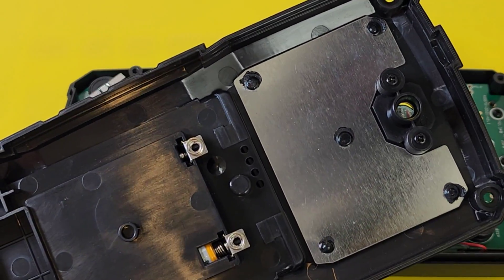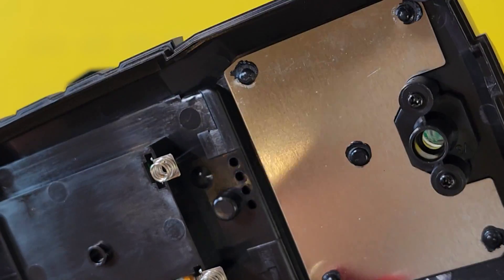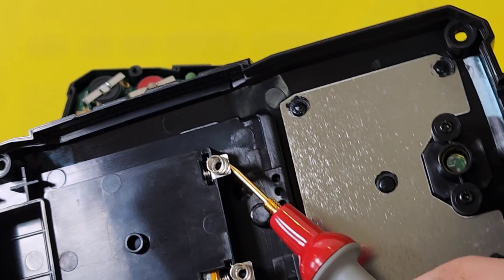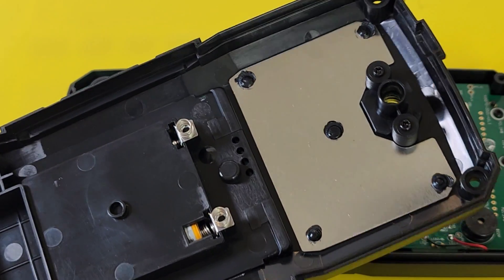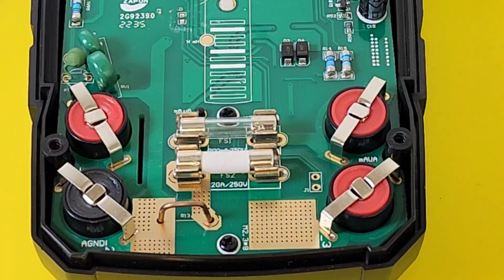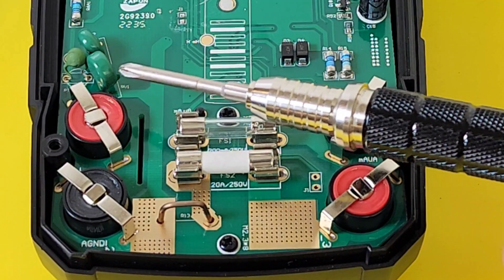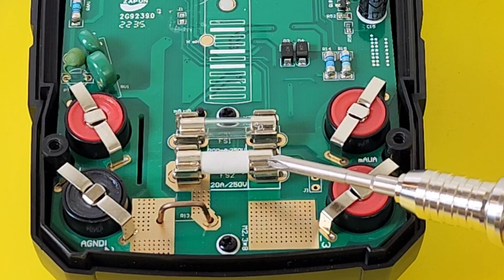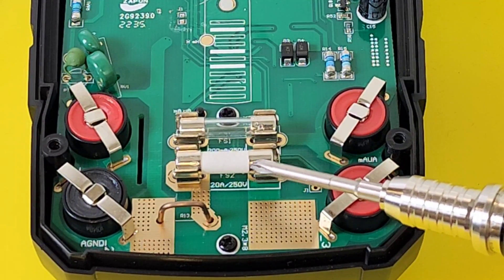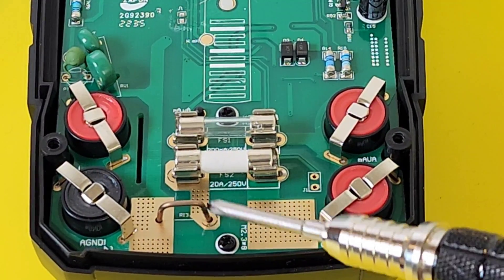Look at the fit and finish on those terminals — positive, negative terminals. We have springs with a nice metal inlay on top giving reinforced oomph over the long run. Nice attention to detail. We have MOVs — two MOVs and one PTC. A standard glass fuse on the milliamp side and a ceramic 20-amp, 250-volt fuse on the high current side. Nice creepage distance going on here, and a current shunt as well.